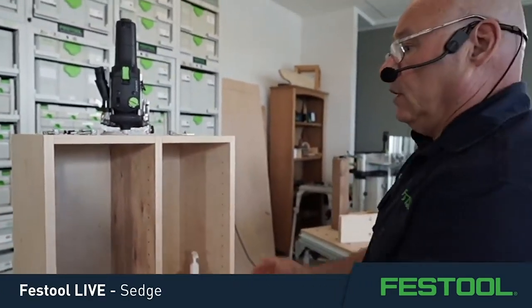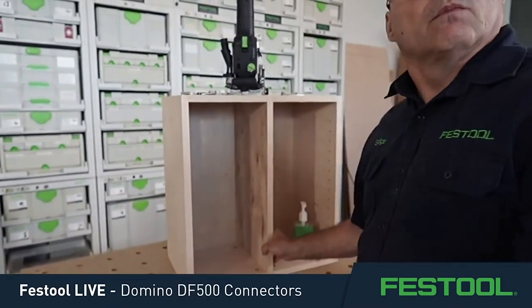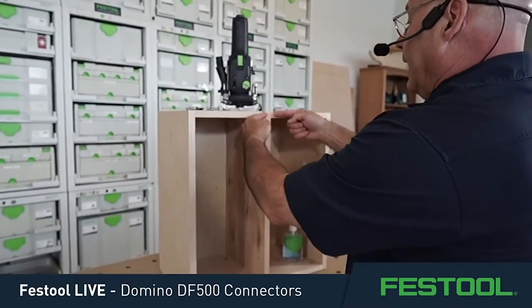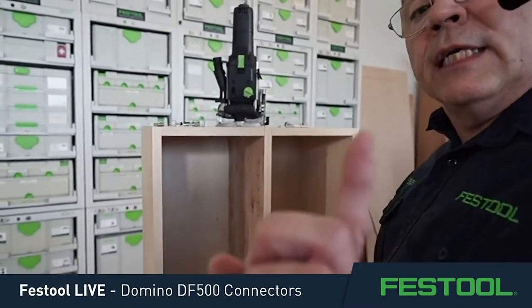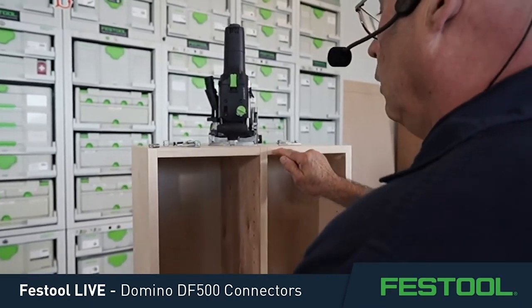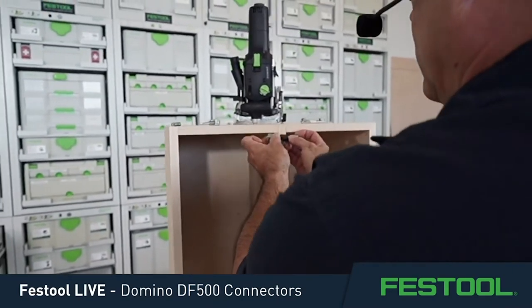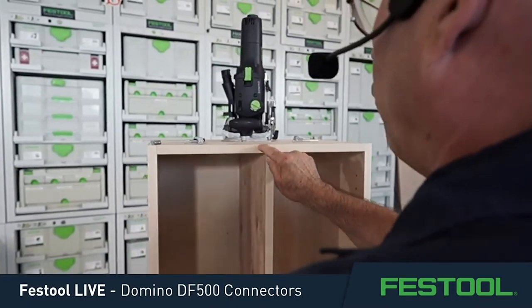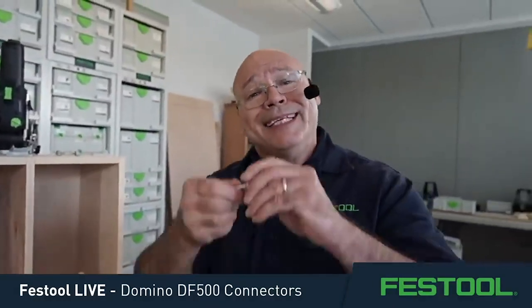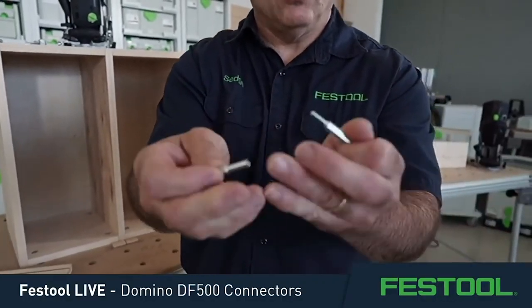Now, let's look at this cabinet. These are not two cabinets. This is a single cabinet with a single center panel. So when I look at this, I need to connect these. I don't want to go through, and I'm going to do this connection point. I'll step you through that today. I have that set up, where I want to do a through mortise here with an 8mm cutter, and then I'm going to put this in so I have two of these cross anchors embedded here, so it's for a through mortise. Now, that's anchor number three. Number four is another system, and if we look, it's the threaded post here, and you're going to notice here where I thread the post into this part here.